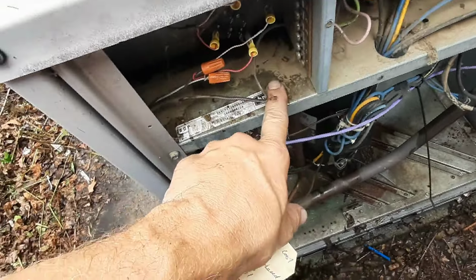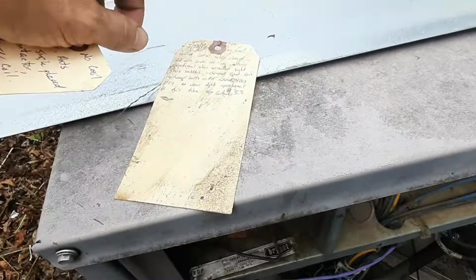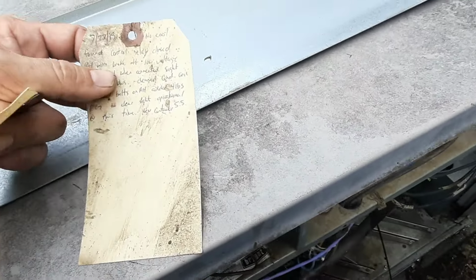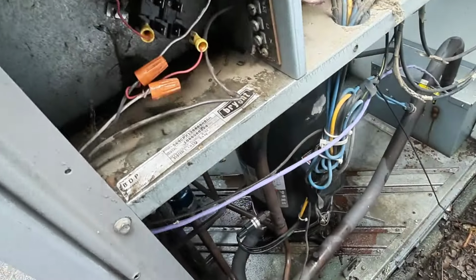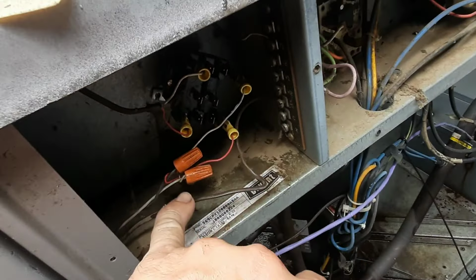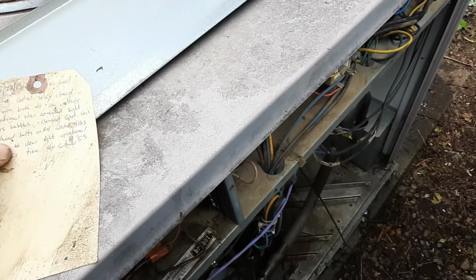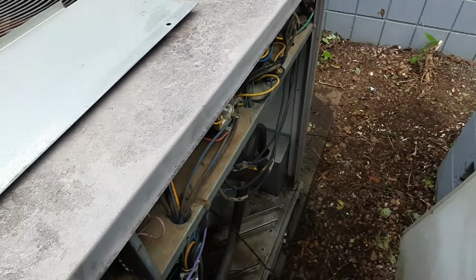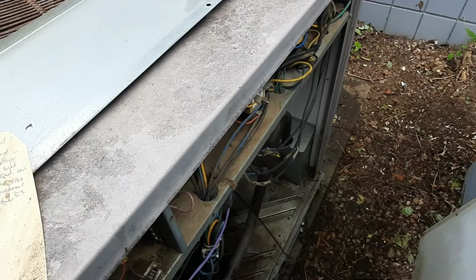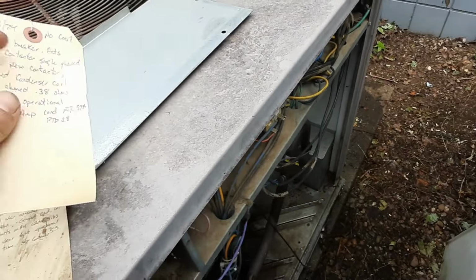You know what I couldn't see inside here because of all the dirt was my tag from 2019. So the control relay was closed. The red wire was broke off the low voltage in here somewhere. I replaced the belts on the air handler. I did note the sight glass was bubbling and added 4 pounds. A new contactor, and it was operational. These tags come in handy.